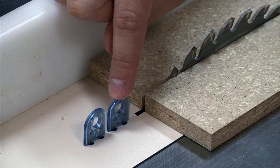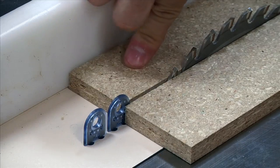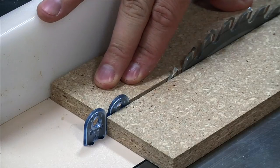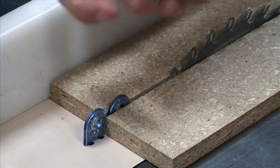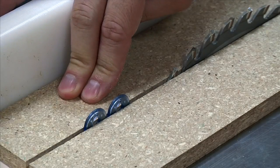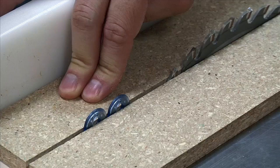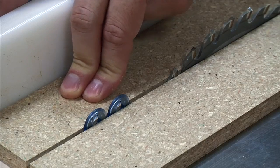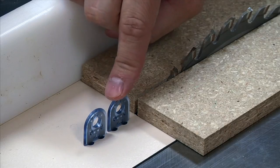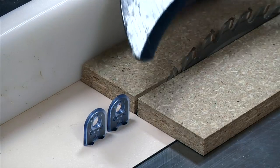The first splitter's job is to keep the keeper workpiece — the piece that's between the blade and the fence — away from the blade. And the rear one is slightly offset to keep the off-cut away from the blade. It's pretty slick and a heck of a lot safer. Certainly safer than using nothing at all, and it could be argued that this, for a standard 90-degree cut, could very well be safer than using a riving knife.